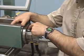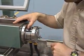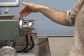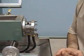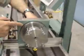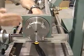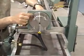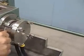Then we have the UHMW tool right up front. And what will happen is the part goes through the tank, it will bring in fresh water with it into the tank and cool the part while it's under vacuum. So this is a fixed tool. It might be hard to see in the video, but the fixed tool means the beginning of the vacuum tool is flush at this point right here with this UHMW.